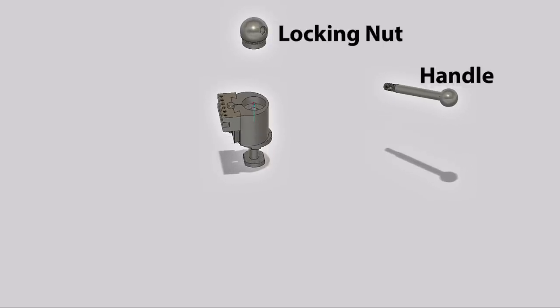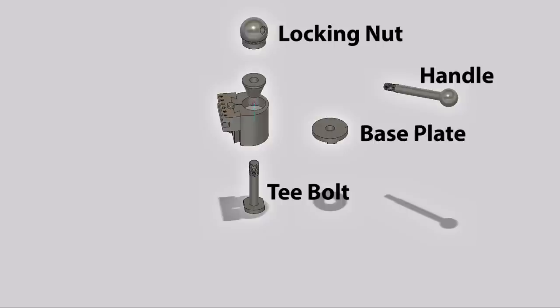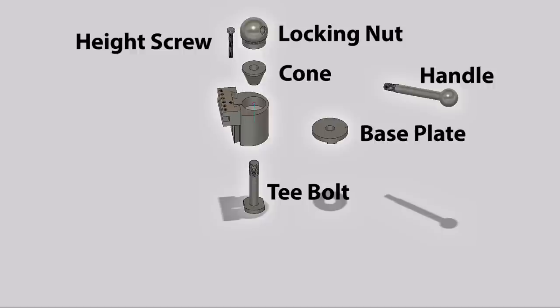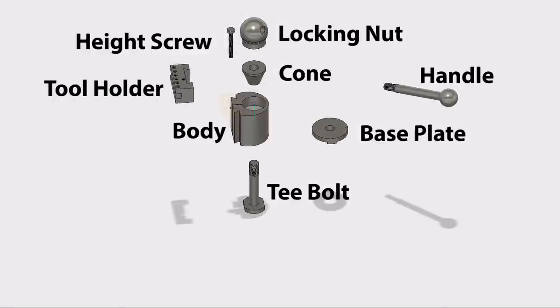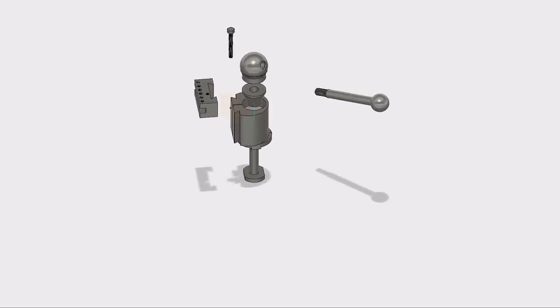There is the handle, the locking nut, the T-bolt, the base plate, the cone, height screw, tool holder, mine was for 1/4 inch tools, and the body. Since my design shares much of what Andy did, I will not make drawings available, but if you're interested in drawings, I have plans on sending a set of prints to Andy to include with his drawings